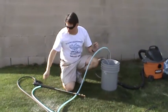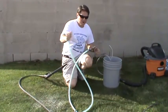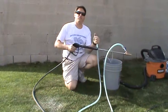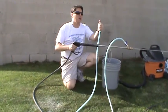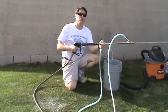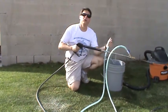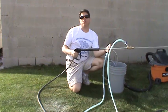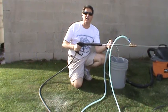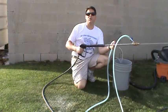Another way to do it is to continually work it out with your thumb — meaning you pull the trigger, you continually have your finger on the trigger so you're creating suction, and you open and close the hose here. What it's going to do is systematically pull that media through the hose and work its way to the blast head. You're not going to get good suction again until you get the hose line free of all the abrasive media and until you get air back into the line. So that's one trick on keeping these systems working.